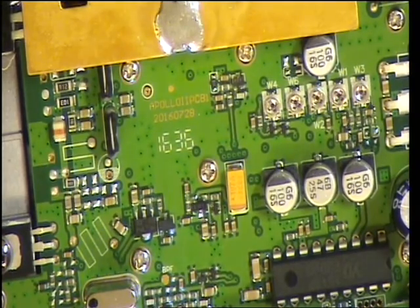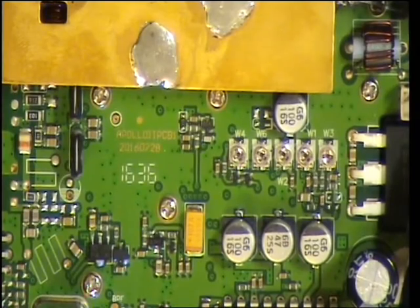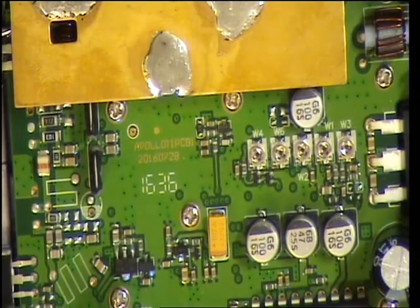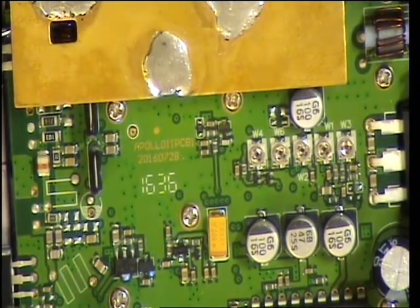So we'll set the signal generator and it comes in at just beyond plus 30. That's fair enough — we always like to check that they do open at some point. There's nothing worse than a radio where you set the squelch to full and no signal, however strong, will ever open it. So there we go — can't argue with that.